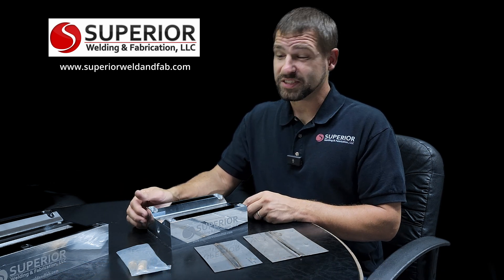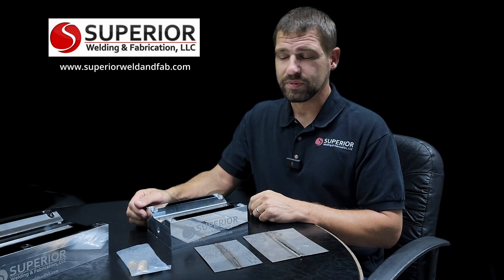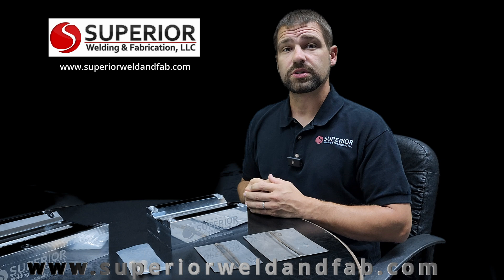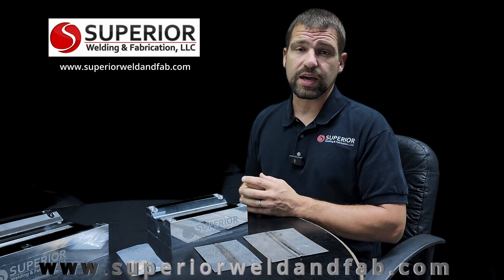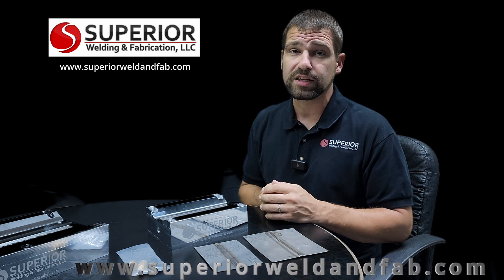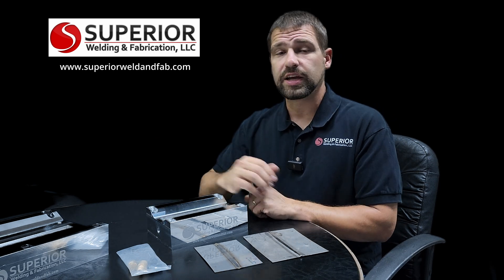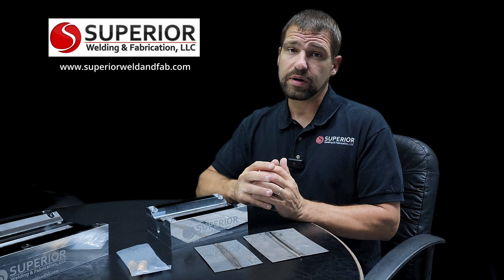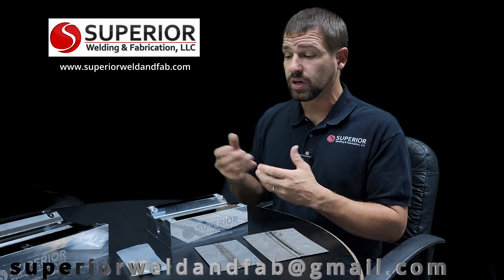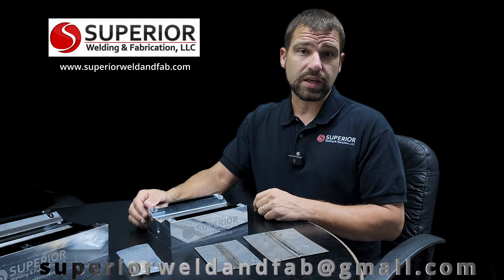The other thing that works really well is if you accidentally put a weld on the aluminum it shouldn't stick, at least unless you're welding aluminum. Over the years we've been asked why aluminum specifically. Aluminum will put less impurities — or zero impurities — into your metals like titanium, Inconel, and stainless. You won't have rust to deal with, which creates a problem when you're welding something that's going to be X-rayed. Aluminum will last a very long time and won't contaminate what you're welding.